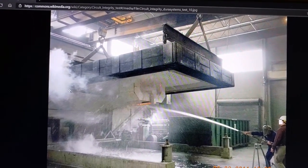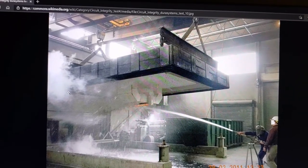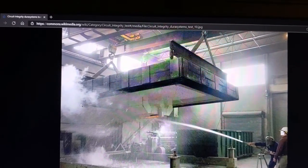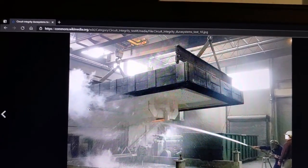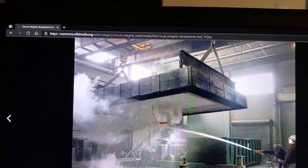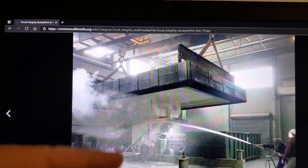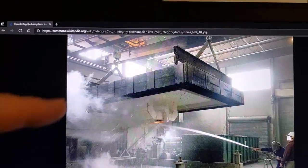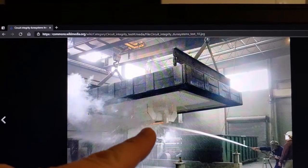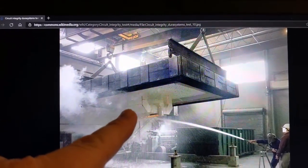Instead, again, presume I'm jiving you, but take a look at the test standards. They do a horizontal sample, they do a vertical sample, which they take out of ISO 6944, 1985 version, which they've all tested to, but never the two shall meet, right? In the vertical test sample, they have the little nubbin of a T connection to nowhere that sticks out. If you test it like this, which is what we do for electrical, then the inside, if it passes this test, the electrical fireproofing test, right?